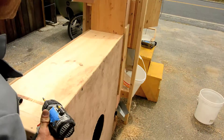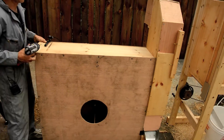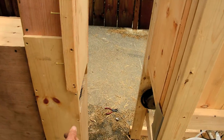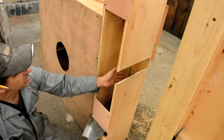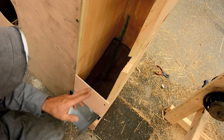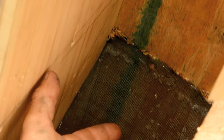The blower just pulls away from the frame. This end of the blower is a stack, and it has a slot in it that the lower screen exits into. Here's the stack, and you can see at the bottom is a tilted screen. That screen takes off the seeds as they fall down, and then the rest of the material that's blowing up goes out the top of the winnowing tower.